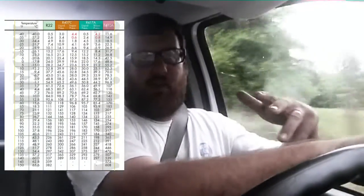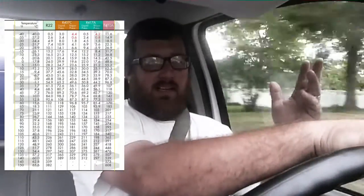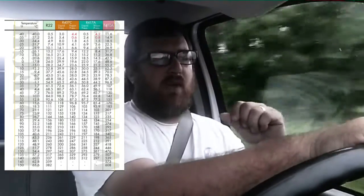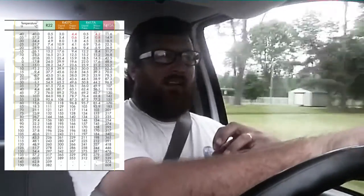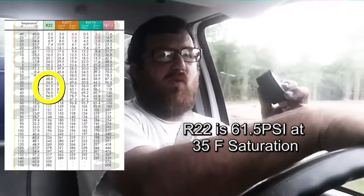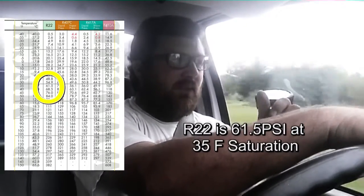When you go to your gauges you'll see the pressure — for R-22 let's say it's around 58 psi — then you'll see your saturation temperature, which will be around 32 degrees. To get your target suction pressure, you take your return temperature, let's say 70 degrees dry bulb at the return going into the unit. For a standard evaporator coil the Delta T is 35, so you take 70 and subtract 35 to get 35. That remaining 35 is the saturation temperature corresponding to the pressure — your target. On your gauges around 35 saturation for R-22 translates into the lower 60s as far as pressure, and that'll be your target suction pressure.